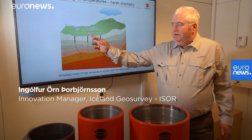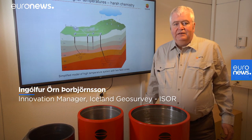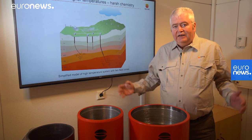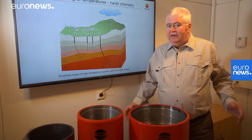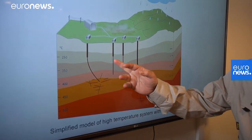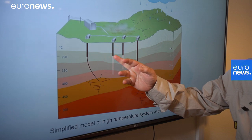Normally when you have geothermal wells going down to get geothermal steam coming up from the earth, you have high temperature and the steel is elongated. It's cemented in and expanding, so that's why you have problems with the casing or the steel in the pipes.